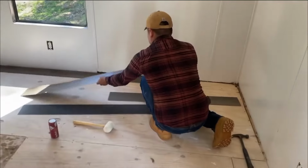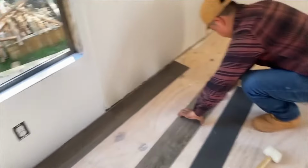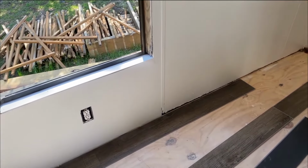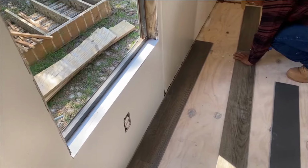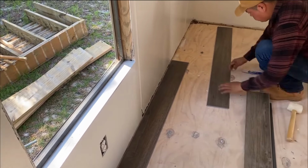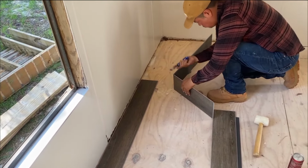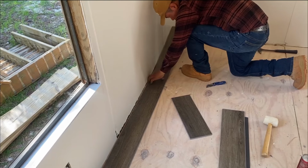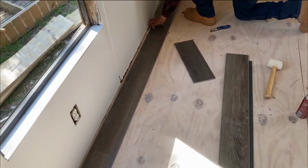And he's over there cutting a piece, getting ready to cut a piece. So basically, you lay this stuff down with a little air gap along the wall so it'll be nice and straight. And then you go to cutting and installing. It should break off there and look good. Just what I like to do, drywall. Score it and cut it and break it. It'll be nice when he gets a few of them down and we'll see what it's going to look like in here.